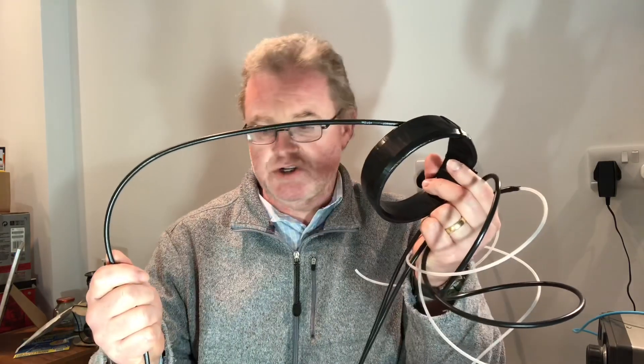About half of it is the stripped-back coax; the other half, the same run of coax, is untouched. The full antenna finishes where it joins the choke. The choke is very important — it stops any common-mode currents coming down your coax feed. Below the choke, this length can be anything; it's now just a coax feeder. Make it as long as you need. If you're working portable, run it down the bottom of the pole; at home, measure how much coax you need or add a pigtail and run some thicker, lower-loss coax.